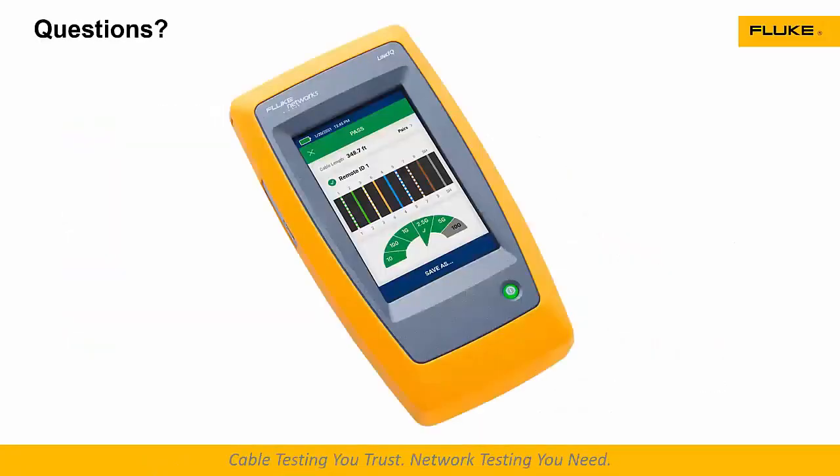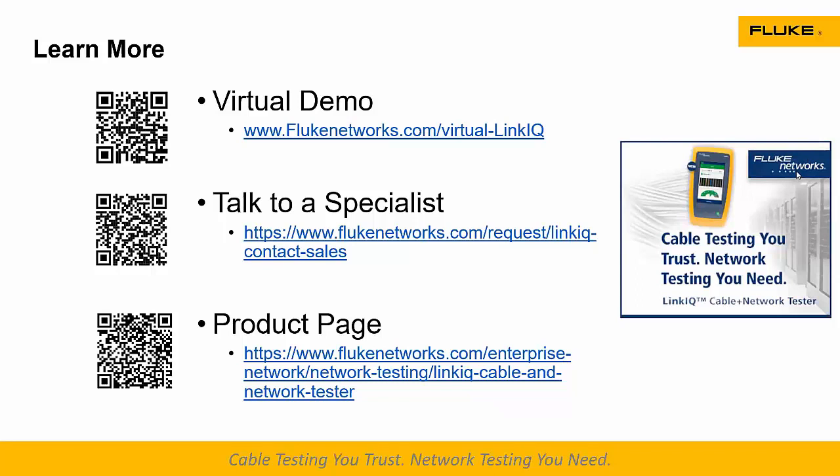The question that always comes up: can it tell what category of cable I have? Unfortunately, no. For that you need a certification tool. There's a standard that's been developed for many years — TSB67 came out in 1995 — representing the best experience of the industry, involving people from 802.3 and companies like Cisco saying this is what we need your cabling to look like. We always preach that for new installations you should use a certification tool. Let's certify the cable. Let's use LinkIQ for our maintenance. But no, we're not going to tell categories — we are going to tell you what speed it'll support.